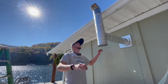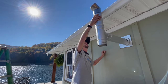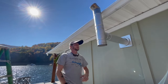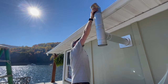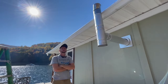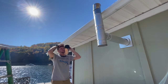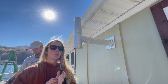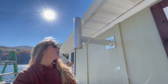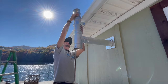You're supposed to have a one-inch clearance on this pipe from anything combustible. And then it needs to be two feet above the overhang. So we'll have to get another little segment of pipe — we need a two-foot section. Again, with these kits, they send you all kinds of things you don't necessarily need and not exactly all the things you do need. So we'll have to supplement. I think you should go into business making functional kits for wood stoves.